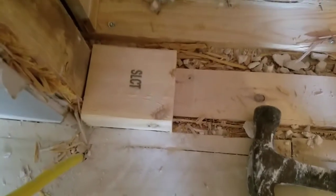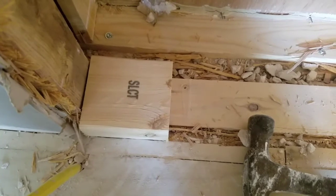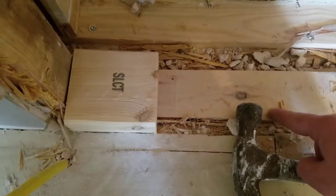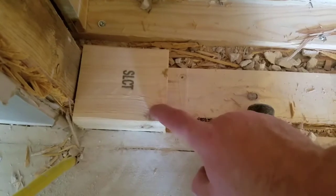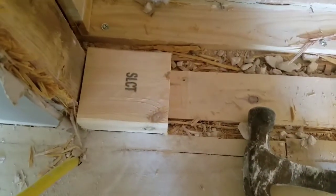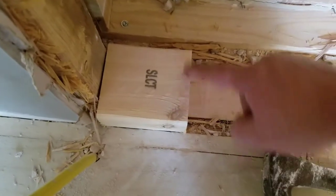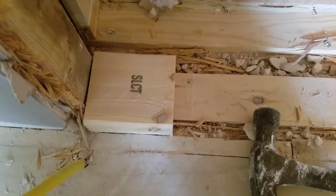What I've done here is cut out a 4-inch block. The reason I did that is because this piece of wood used to frame up this wall is only 3 inches wide. I wanted to give myself something as wide as the 2x4s I'm going to be using, in order to have a better place for them to sit on. Probably didn't have to do this, but it gives a little more of a place to sit on and I won't have any of the 2x4s actually overhanging.